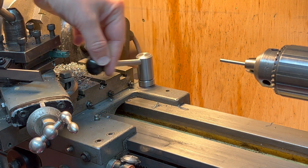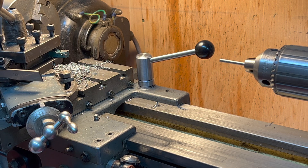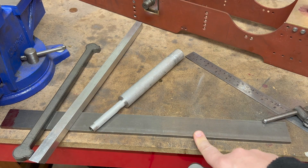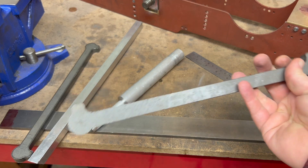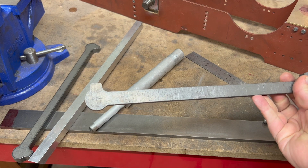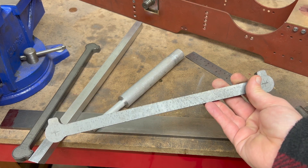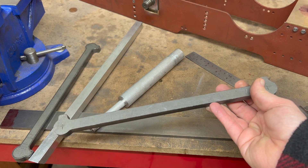I now have a locking lever for the carriage which is really easy to manage. The original instructions suggest cutting from bar material, drilling two pilot holes through for a one-eighth inch pin, reaming to pin size, and then using that to clamp both sets of rods together and machine the rods as a single unit in all dimensions except the thickness.